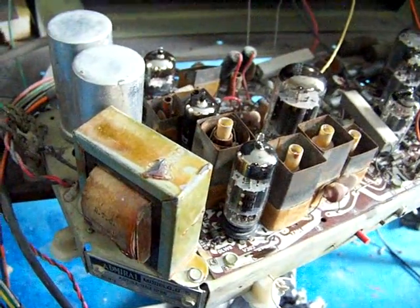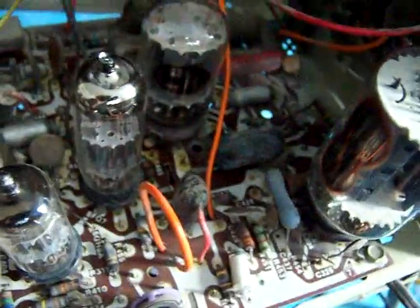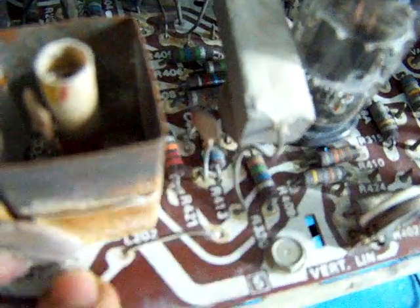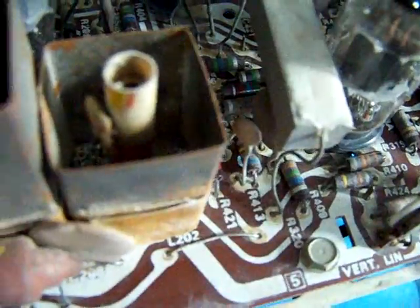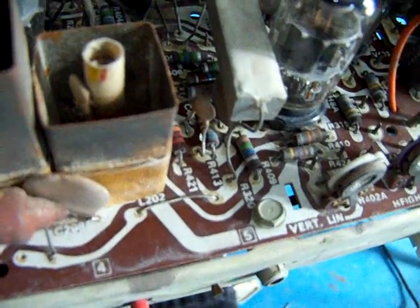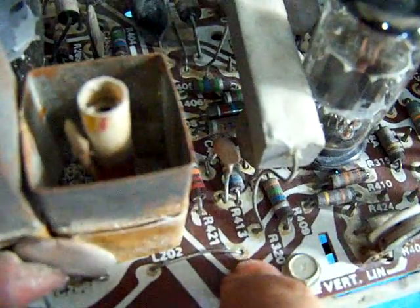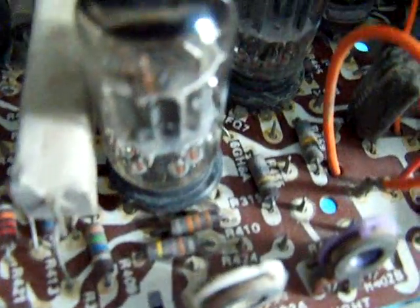All right, give this thing a good dusting with some brushes. Quite a difference. It's not perfect, but it looks better this way. Water damage is a little bit more apparent on the top part. This yellow stuff kind of worries me. I thought maybe it was rust, but now I'm thinking it might just be 50-year-old flux or something. If you look at it, the actual leads where those spots are aren't corroded or anything. So I hope that's just flux.